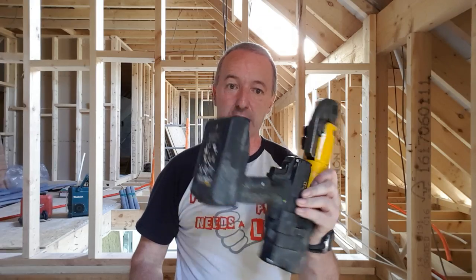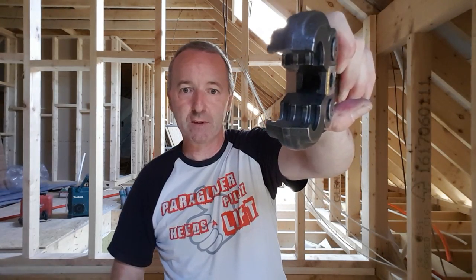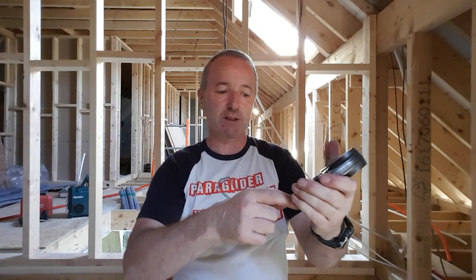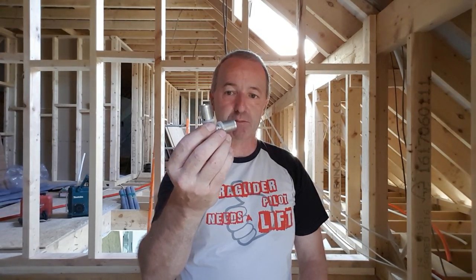These fittings are really, really good. Very good. But the downside is these are expensive, and you need one of these machines to run it. So crimp fitting is very, very good — fantastic success rate with them. Sometimes they can be very hard to get in and you can't always get that machine in, whereas you can get a nut and ring compression fitting in. These are the jaws — you can see how they're fixed up inside. It squashes down and clamps it, leaving noticeable ridges on the ferrules so you can tell when one has been done. You won't pull them apart anyway. That's how you do fittings in situ.